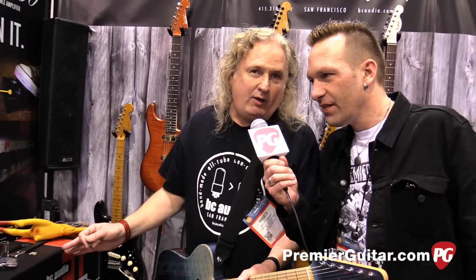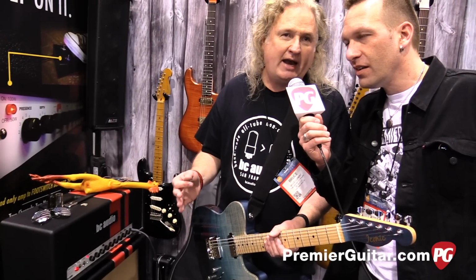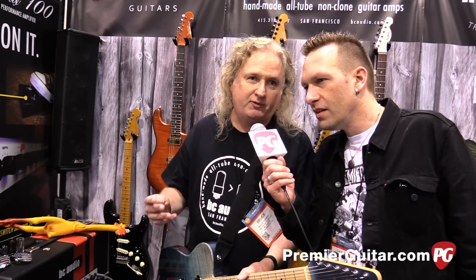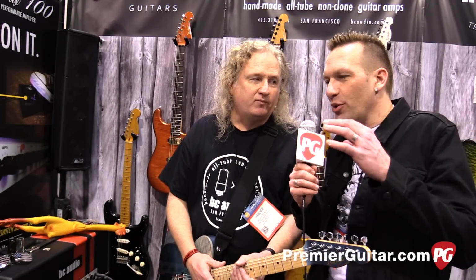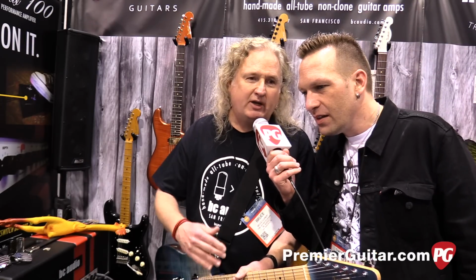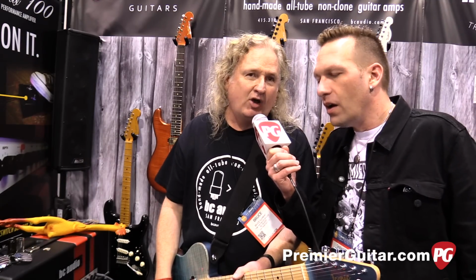So, whatever volume you're playing at, club volume, small club volume, restaurant patio, Sunday afternoon jazz gig volume, when you hit the switch and go from 50 watts to 100 watts, the amp is going from 2 output tubes to 4. You get 3 decibels of boost coming out of the speaker. And to some people, maybe the number 3 doesn't seem significant, but it's a logarithmic scale. It doesn't sound like much, but it's the perfect amount for it. If it was more than that, your sound guy would say, "Oh, what's going on?" and turn you down. So it's a perfect amount of volume boost.